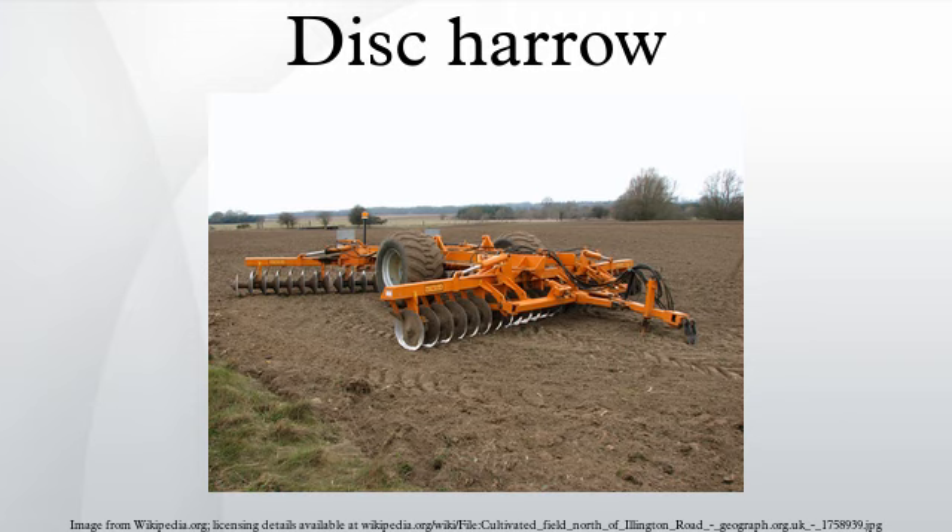The notched disc blades chop up stover left from previous crops, such as corn stalks. Disc harrows incorporate remaining residue into the topsoil, promoting rapid decay of the dead plant material. Applying fertilizer onto residue on the surface of the soil results in much of the applied nitrogen being tied up by residual plant material, and therefore it is not available to germinating seeds. Disc harrows are also generally used prior to plowing in order to make the land easier to manage, and applying a disc harrow before plowing can also reduce clogging and allow more complete turning of the soil during plowing.